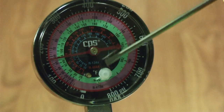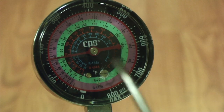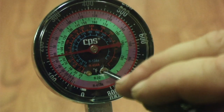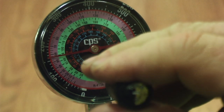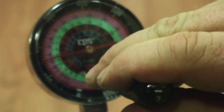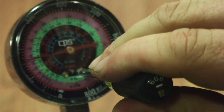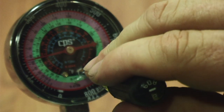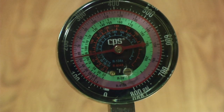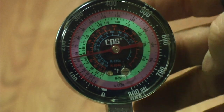But what you would do to adjust it is take off this cap, take your little thermostat screwdriver, stick it in there, and adjust your needle left or right — see how it moves — until you get it right where you want it. Some set screws are in the back, some are in the front. Just have to find your screw and adjust it.